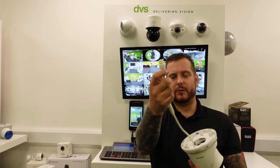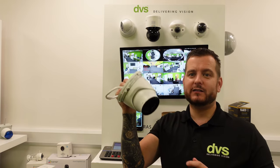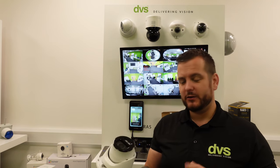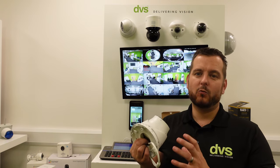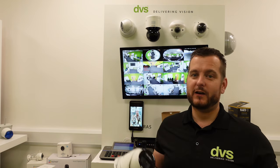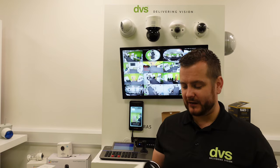You've got your 12 volt or PoE connection — put the jacket on there to make it waterproof. For back boxes, you can use the normal DM21s bracket or the new PT6 bracket — both fit. The PT6 bracket gives it a little bit more waterproofing, which is why they recommend it. But the DM21 does fit, it's fine, and will give you a good seal. You can use either the DM21 or the PT6 — the spec sheet moving forward should reflect that.